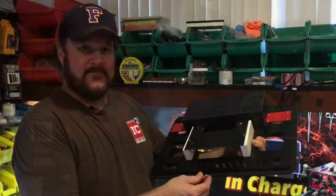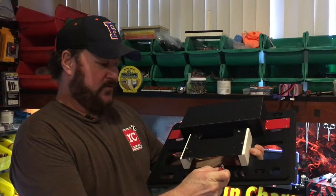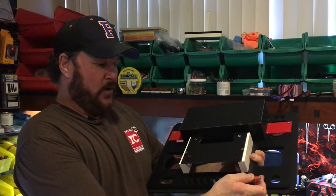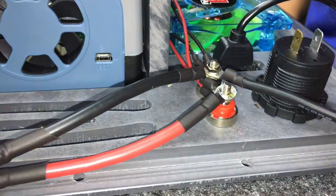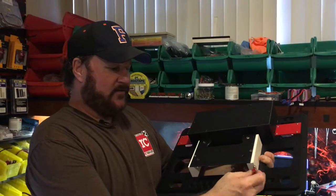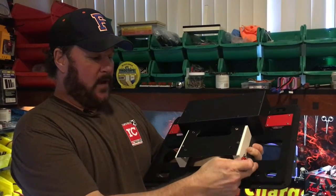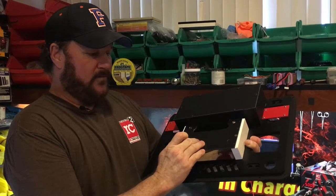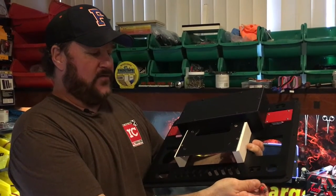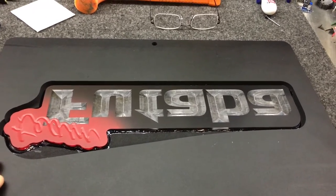With this case the customer has the mooch plugs. After you have the charger mounted with the pigtail hanging out that goes to the EC5, you'll put on the corresponding EC5 and go over to your ring terminals, solder those on, and heat shrink them. You'll make a connection on a banana jack which has double locking nuts. You'll go down to the pigtail, down to your power supply — that gives you a good termination joint. When you plug power in, you can run your charger via 12 to 24 volts DC, or if you plug in your power supply you can use this as a mooch plug to run other chargers.